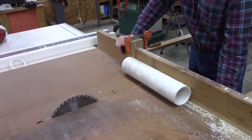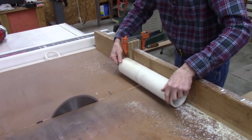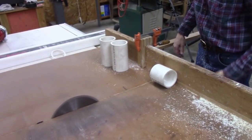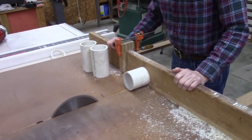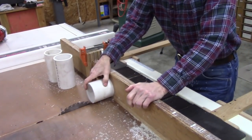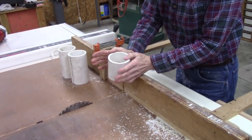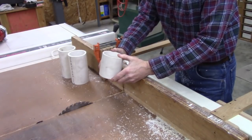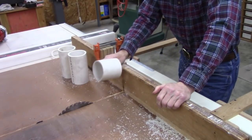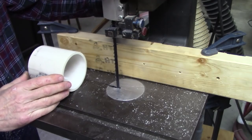So I'm going to make this six inch — you can make it whatever length you want. In the last video I lowered the blade and cut through, then flipped it over and cut through again. When you do that, the tubing tries to collapse a little bit. I don't really think it's dangerous if you've got a cut-off sled, but I'm going to try cutting that on the band saw and I believe that will work pretty good. I've clamped a 2x4 guide to my band saw. I have no idea if this is going to work good or not, so let's just give it a try.